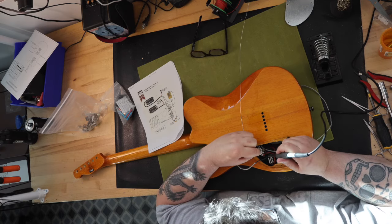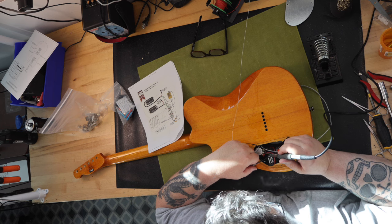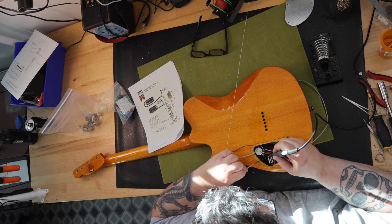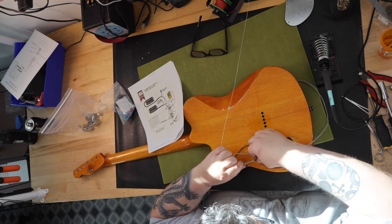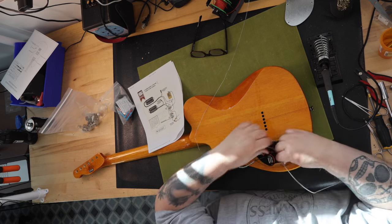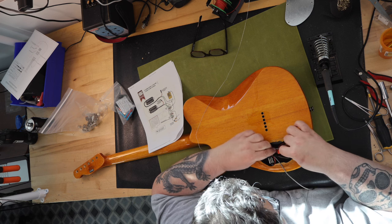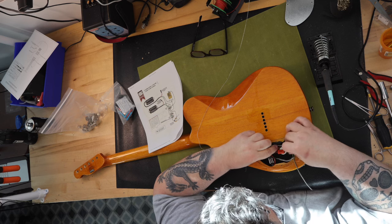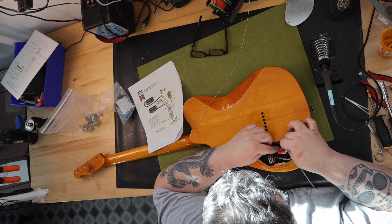Here's where the guitar deviates from a Gibson Les Paul and moves more toward an SG — it is light as hell. My guitar with everything in it weighs in at 6 pounds 6 ounces, and it's a very comfortable guitar to play. For my wiring harness, I built a traditional Telecaster circuit with a few deviations: the volume and tone pots are both CTS 500K pots for the humbuckers, the capacitor is a .047uF drop cap, and the three-way pickup selector is a Switchcraft toggle-type switch. I chose to go old-school and did not do anything fancy like the factory's push-pull tone pot for coil splitting.